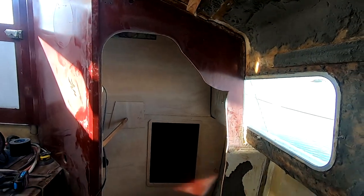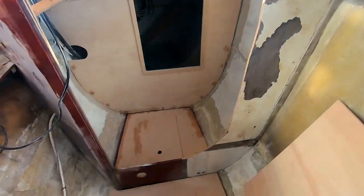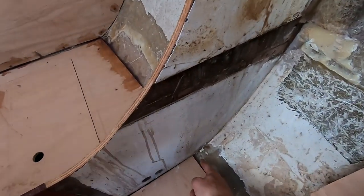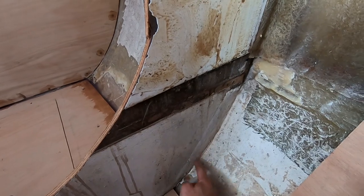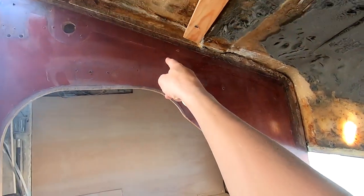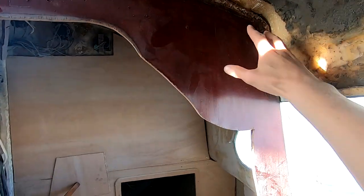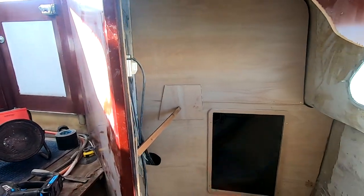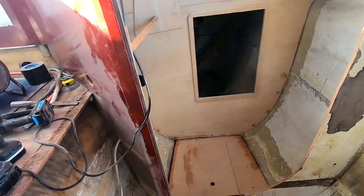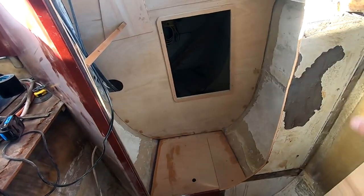What I'm going to look at now, because I can't do much back there, is work out where I want the opening. So I'm thinking the furthest over I can get to where the hull starts peeling round, I want the line straight up through, up, around, and then sort of down. So I want it over this side more than that side how it was. And I'll put that sheet over the top so it's got maximum strength. This will be double skinned, that'll be double skinned. Loads of strength there, and that'll allow me to open them up.